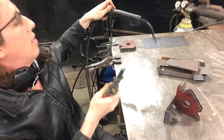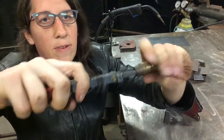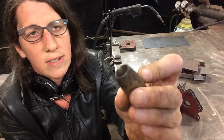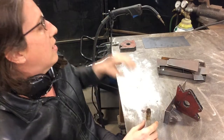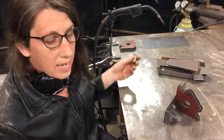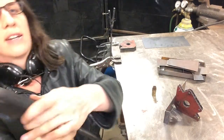That's important because this little nozzle is where the argon is going to flow out to protect your metal from burning. The nice part about the whelpers is the tips of the pliers are designed to seat in the cup of the welder and clear out all the excess gunk from the interior of that head, so it should look nice and shiny. A clean shiny brass interior allows all of your argon to flow smoothly. As you're welding, slag will build up on that interior, so if you're welding for an hour straight, it's good to take a minute, take the cup off, clean out the tip, and then address the nozzle as well.